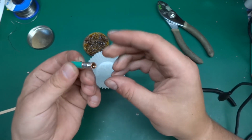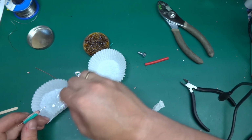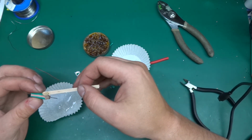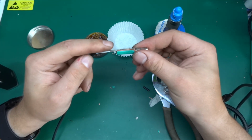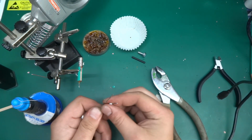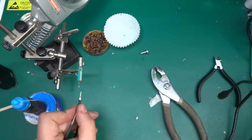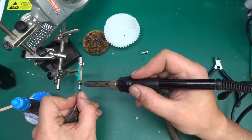So now a little bit more epoxy, and I'm going to put the outer sleeve on. I've just got some pre-mixed over here, and that's just going to go on the outside edges of the pencil. Okay, I've got this whole thing solidified, and I've got the wire pre-cut, so it connects like so. So now I'm just going to tin those wires. Okay, and with a little bit of heat shrink on both cables, I should be able to get those soldered in. Plug like so.